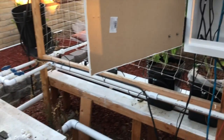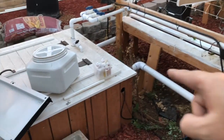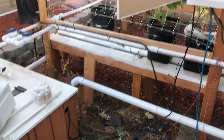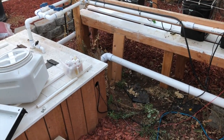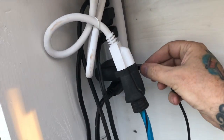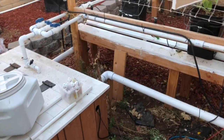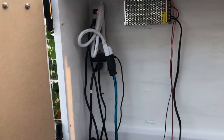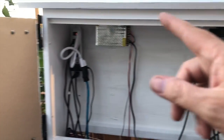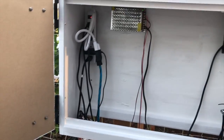And then I just run the sensor wire. So that's the only reason why I might not do that, is that node has 2 sensors on it. So I'd have to run two conductors out to it instead of the one cable I have right now. That one's being powered by a USB phone charger. And I might, if I put more outlets in here down the road, I can probably power that one with the same thing rather than from the power supply, and just use the power supply for remote nodes.